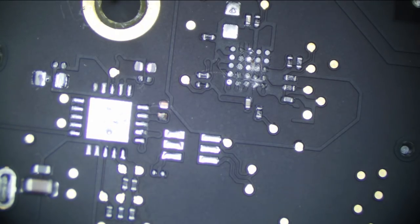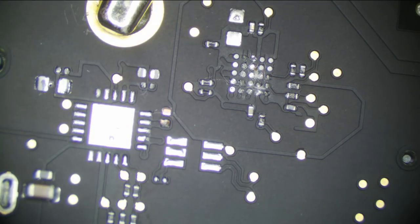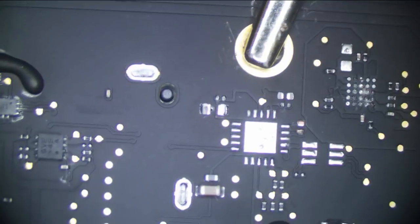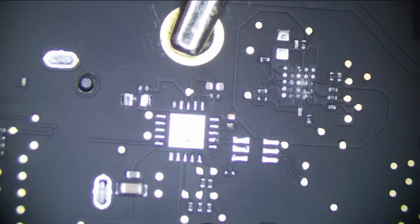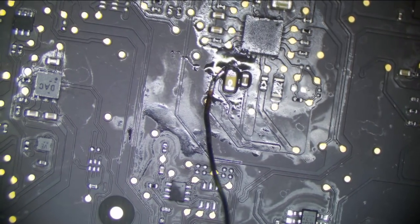Okay, let me put a little power on the board. And current draw is down. It was something right here. It was probably the darn... how could the backlight driver do that? That makes zero sense. And I honestly think that's what was getting hot originally. Now the real question is, do we get CPU V-core? So we have a lot of stuff removed. It's nothing essential, though. Everything could go without, except the backlight driver.